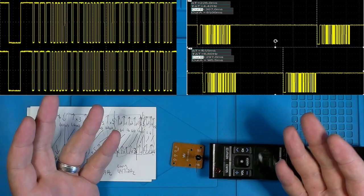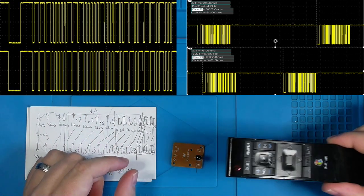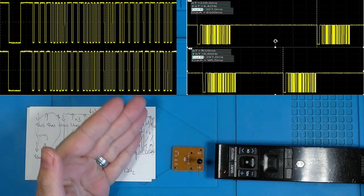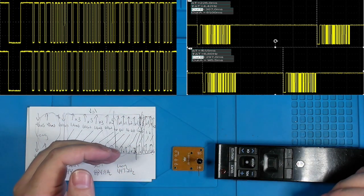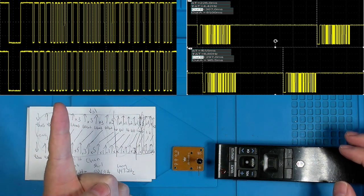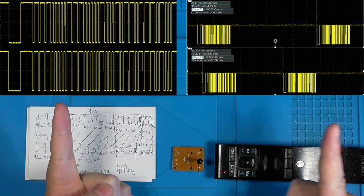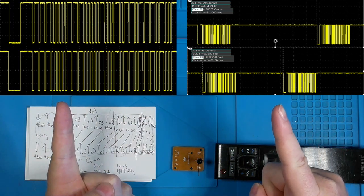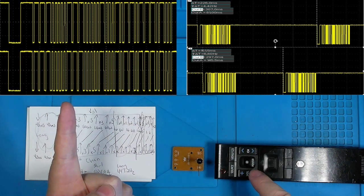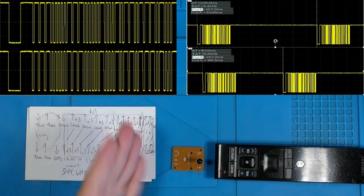And so we actually have two subsets of information that is needed to make a transmitter or remote communicate with a receiver or a television in order for an operation to occur. One, they've got to present the correct information to be able to communicate at the get-go. And then two, the spacing or frequency in which that information is repeated is going to determine what button was pressed and the corresponding change that should now occur.